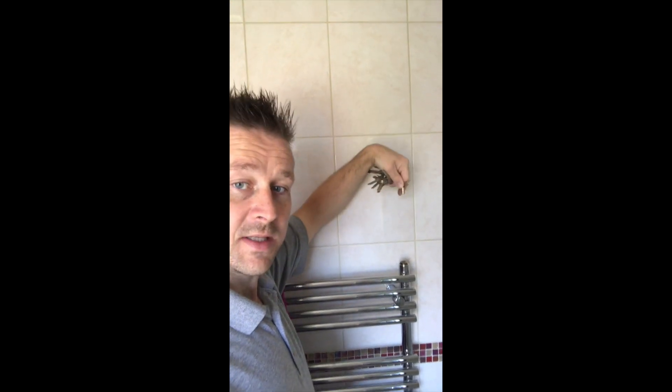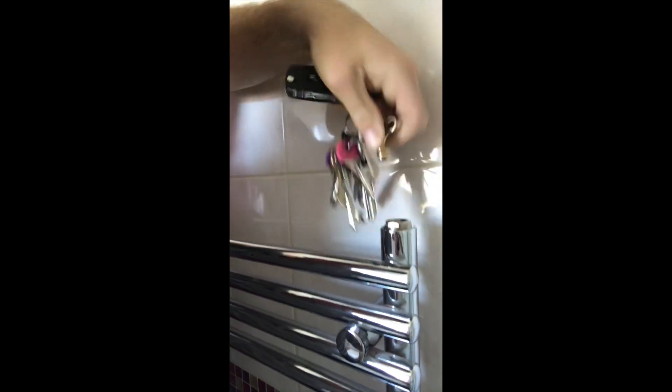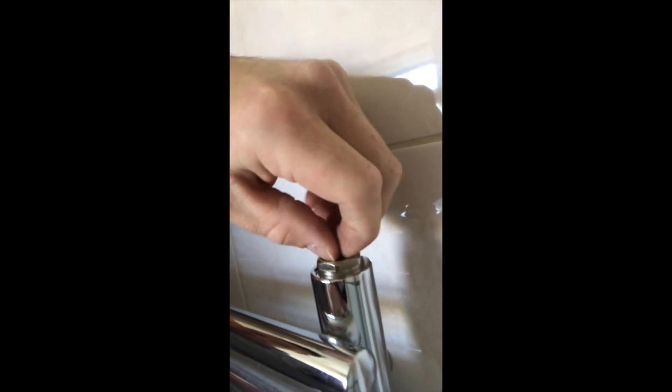So now all the water is draining outside and I'm happy that the feed and expansion tank in the loft has gone empty, so the water is coming down. I then go to the first upstairs radiator — this is a towel radiator in one of the en suites at a higher point. I'll open that up and you'll hear it sucking the air in rather than squirting air out. That sucking noise confirms that the water is emptying and going outward. Now I'm going to go around all the other upstairs radiators and open those bleed valves, give that a minute, then go downstairs and open those bleed valves too.